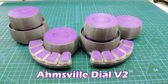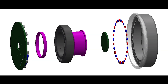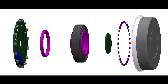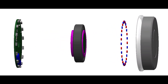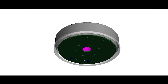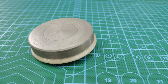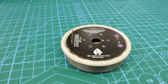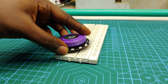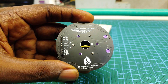This will also be the subject of my next video, so look out for that. A few improvements and refinements to the encoding method since its development has brought me to this. I designed this standalone encoder so you guys can easily integrate this magnetic rotary encoding method into any of your Arduino projects, should you find a need for it. It's mostly 3D printed, so it's easily customizable, and I will be releasing the step files to help with easy modifications. The encoder is breadboard compatible and can also be attached to anything using the three screw holes at the back.